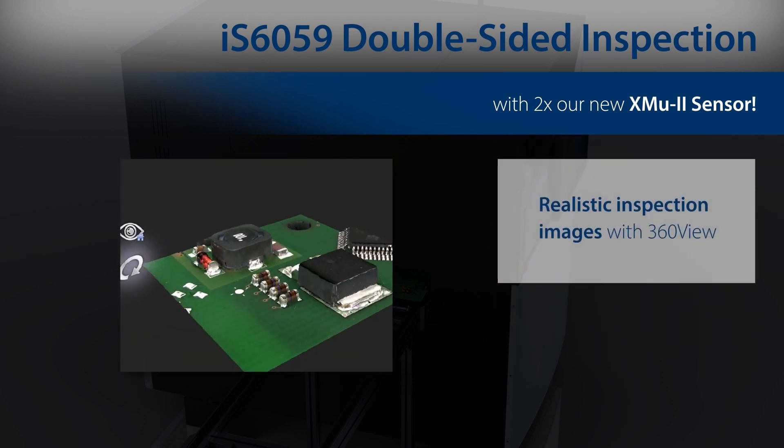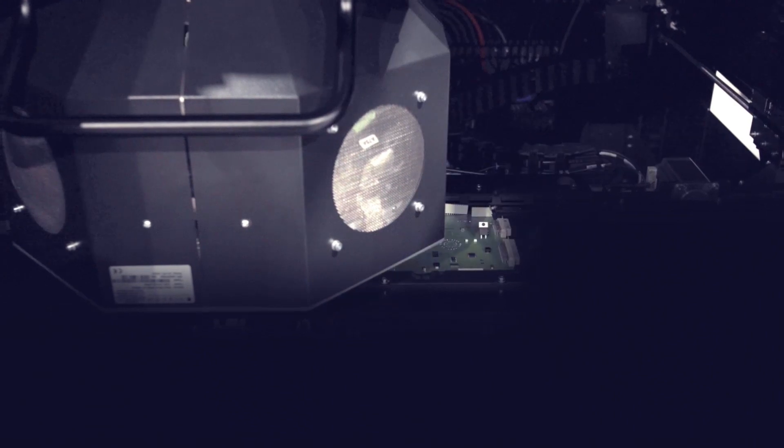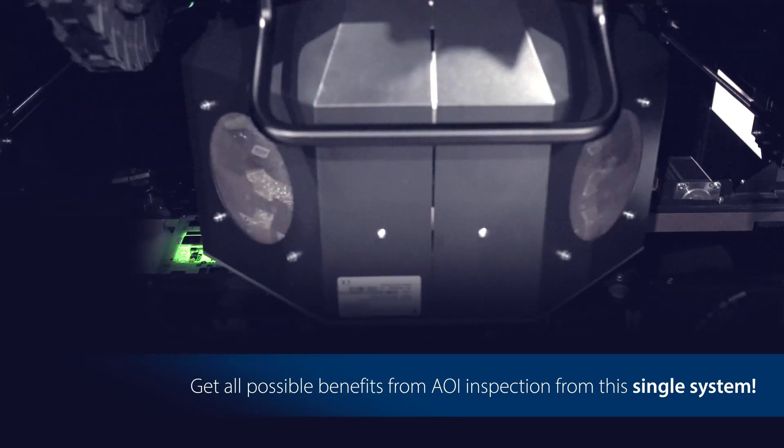So what sort of features does the new platform actually bring? First of all, it's much faster than the previous generation — about 25% faster on average. This comes with a new camera system; we redesigned our XM camera module family. They're all 3D but have different resolutions. Now we have a larger field of view, which leads to faster cycle times. The new system family is built on a new frame that has more similar parts, even between the AOI and AXI series. We use similar components, which makes it much easier with spare parts, shorter lead times, and things like that.